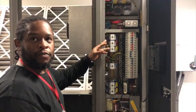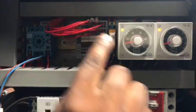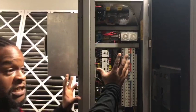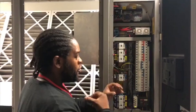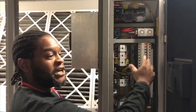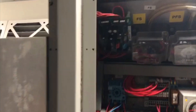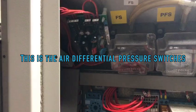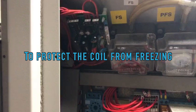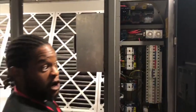Up here you've got your pressure differential — these are your time switches. This is for start-up procedures. So when you energise the unit and call it to run, it will be a certain amount of seconds before it kicks the fan in. That's to stop the pressure differential kicking up. If the fan doesn't come in time before the pressure differential wants to read it, it will just go into air flow alarm.